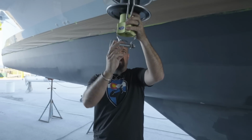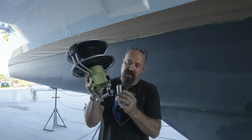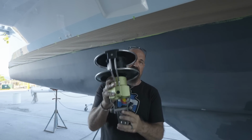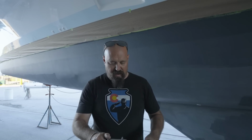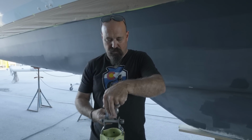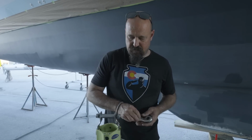So now we've got a close to deck installation. The eye that will get threaded on the end of the forestay will come through here and go through this pin. And then this will actually hang on here that attaches to the deck. I suppose I should probably test fit all that, but that's the way all of that goes. Are we ready to put our furling tubes out and lay them out so we know how much to cut off yet? Let's see. All right, let's do that.